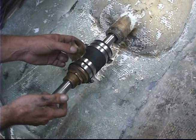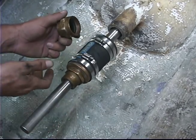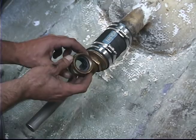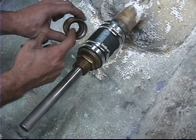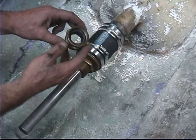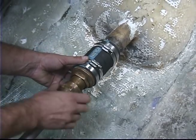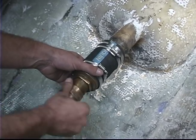What we use to keep water from coming in and allow the propeller shaft to freely turn is what's known as a stuffing box. This consists of a couple of different parts — one is the packing gland, or stuffing gland, where a graphite or teflon impregnated material is wrapped or stuffed within it, then placed over the shaft and screwed down onto the packing gland, thereby creating a seal.